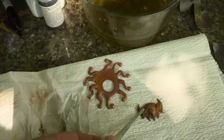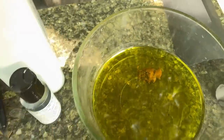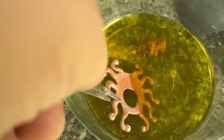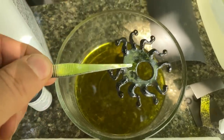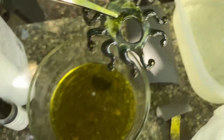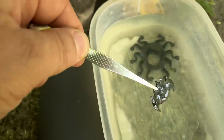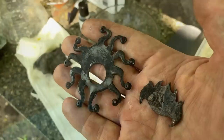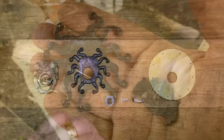It's time to head outside and use some stinky chemicals to make a patina on these copper elements. I'm using a solution of liver of sulfur, which smells really strongly of rotten eggs — if you're going to try this yourself, I highly recommend you do it outdoors. Just a few minutes in the solution gives the copper a really dark patina. I'll neutralize those in a solution of baking soda and water, give them a rinse with a garden hose, and then take a moment to admire my handiwork before heading back down to the workshop for final assembly.